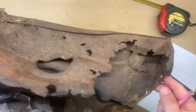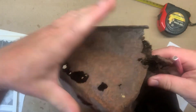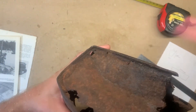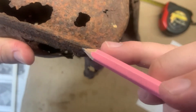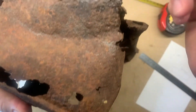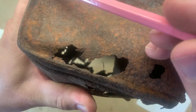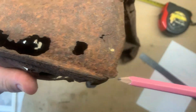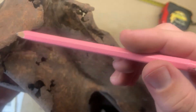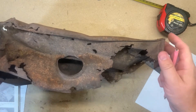That unusual seam that we saw before indicates that this is all made out of one piece of steel. On this side here we have one piece of steel coming around, and look - there it is, there's the seam right there. So this back piece, as long as the rest of the body, is one piece. This is the same piece here, and then it's being seamed all the way up and around and around the top. What a clever little bit of manufacturing - this fuel tank is made out of one piece of steel.